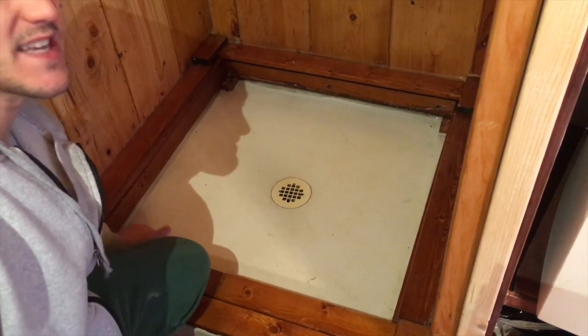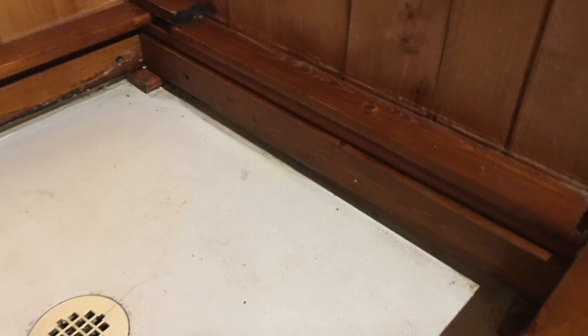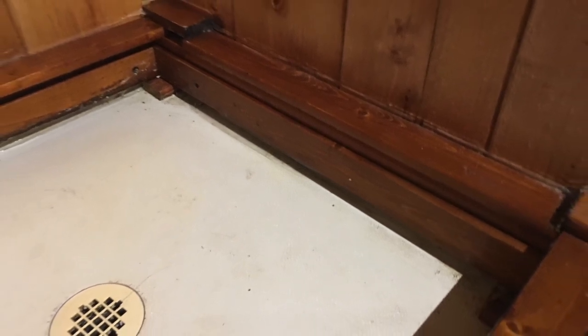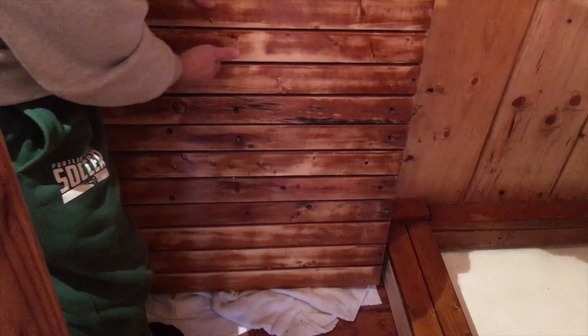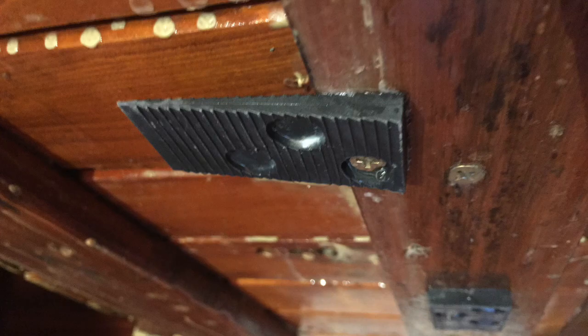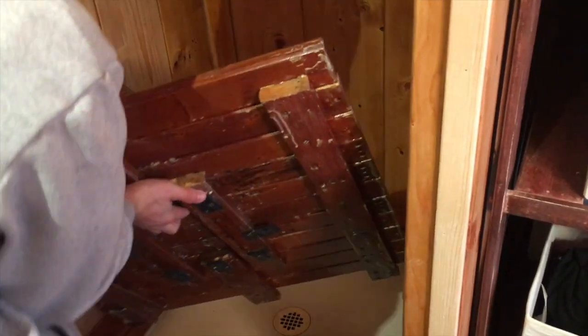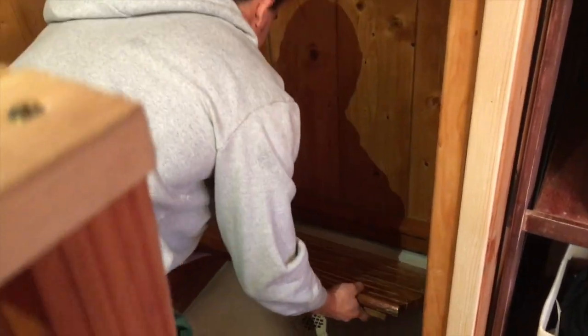For the bottom of the shower, I made a border with smaller boards using the same sanding and staining techniques with Helmsman. Make sure the border is tight and well-measured because it pushes the bottoms of the boards flat — handy for any warped boards. The bottom piece has plastic risers to keep water flowing, and I put on a thick layer of Helmsman since it gets extra water and moisture underneath.